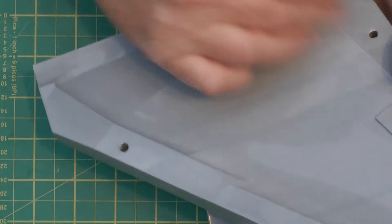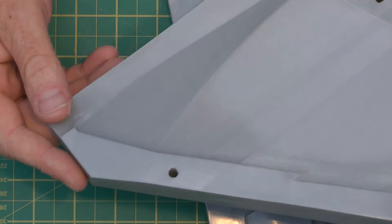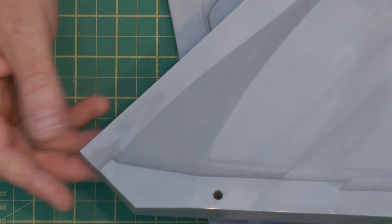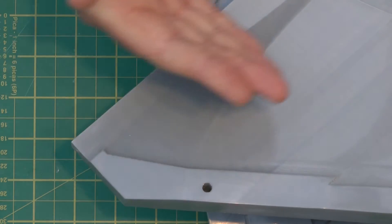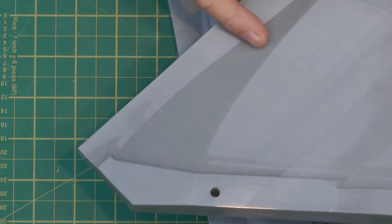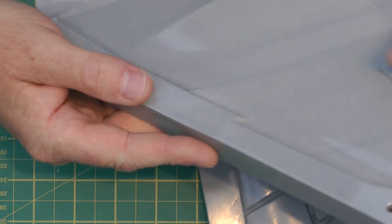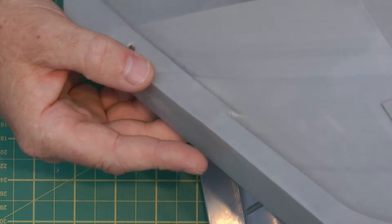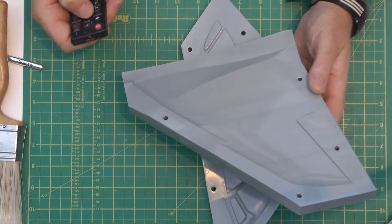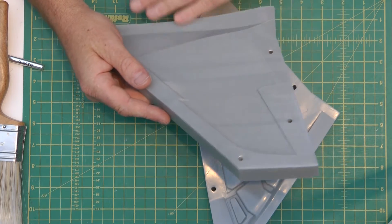From a printing point of view, the ringing is a pain because you've got to sand it out. But from an aesthetics point of view, it's really quite beautiful. And even where the infill on the inside is attaching to the plastic wall, there's a slight heat difference and you get this lovely almost grain effect on the side that follows the part. I really want to have a play with surfaces and textures more from a sculptural point of view, because it is really beautiful. I never thought I'd say I found plastic beautiful, but it's absolutely gorgeous — very tactile once it's polished.